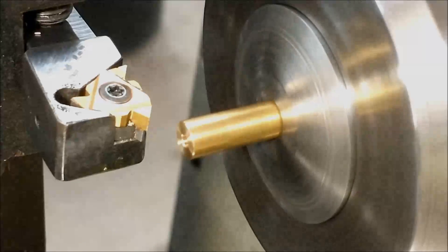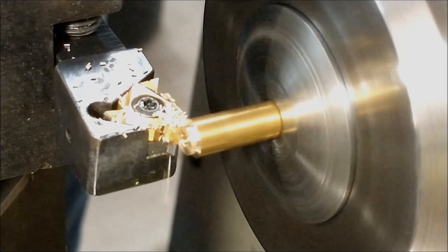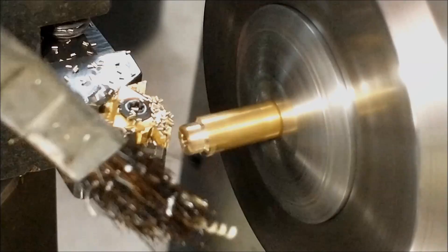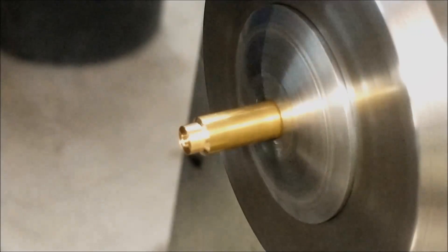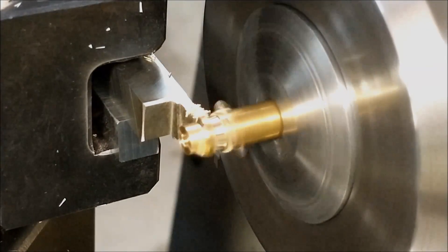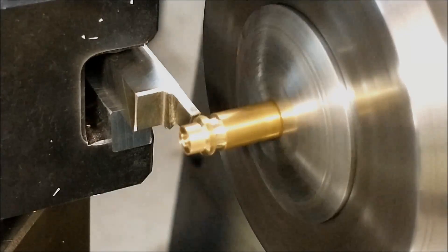This particular flange has a cylindrical diameter that runs out to a 30-degree flange. Now, instead of grinding up a form tool, I'm using a threading tool here because you know half the tool is 30 degrees — so why not use the tools that are available to you? Coordinating your tools allows you to just position them pretty quickly to do whatever you really want to do.